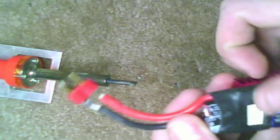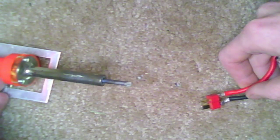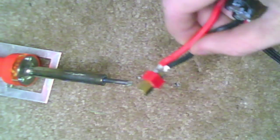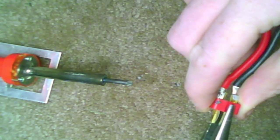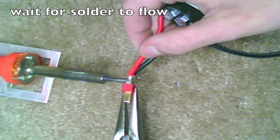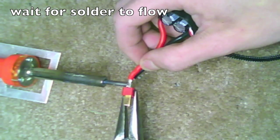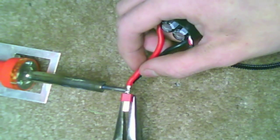The first thing we are going to do is take the Deans off. I am using a soldering iron with a little flat spot on it. Really all I do is take the flat end of the Deans and set it on there. I grip the Deans with my pliers because it's going to get hot. Set that on there and once it heats up the solder flows. Let that solder get warm for a minute — sometimes it takes a second, the soldering gun is probably still heating up.